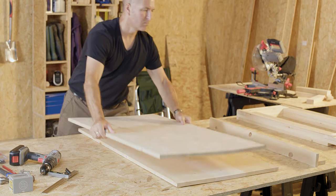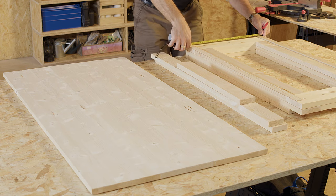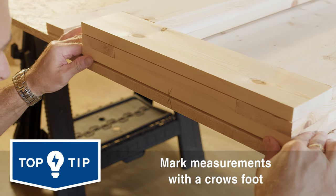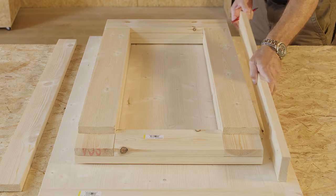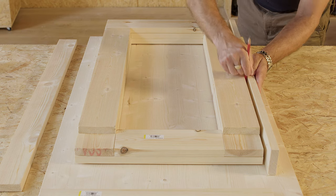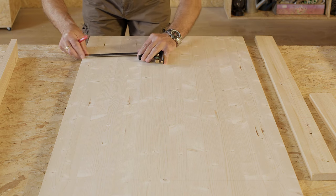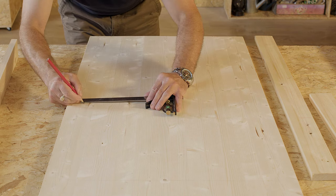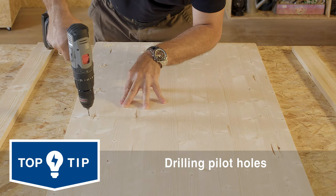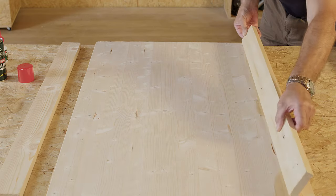To build the table top, start by laying a timber board on your workbench. Measure and mark the centre of one end of the timber board, then also measure and mark the centre point at the base of the drop-down leg. Place the drop-down leg onto your timber board, align the two centre points, and make sure both pieces are laying true and square. Dry-lay the table top framework around the drop-down leg using a carpenter's pencil to maintain an even gap around all three sides, and scribe the outline of the framework onto the timber board. Measure the thickness of your framework timber pieces and halve it, then add this measurement to the inside of the outline and mark your pilot holes. Drill the pilot holes on your table top board, then glue the table top framework into position.